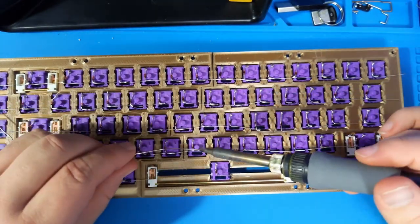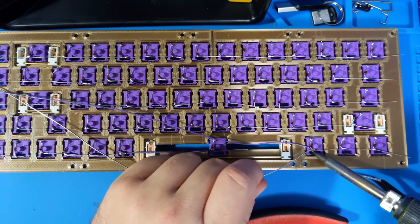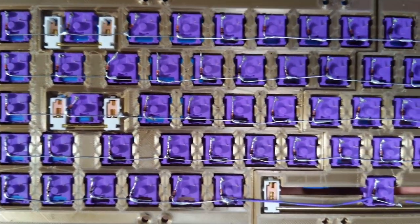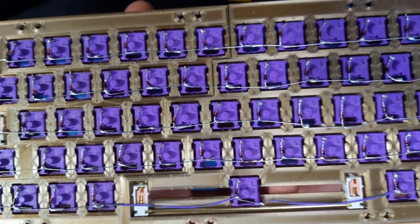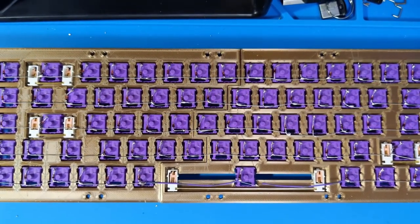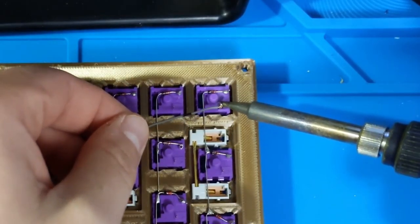After the rows on both sides of the keyboard have been wired up, I will connect them together. Some of the switches that are very far apart, like the spacebar, will require a jumper wire to complete the row. Here is a completed look at all five keyboard rows. To finish building the matrix, the second pin on each switch must now be connected in a column. Wiring the columns is a little bit less straightforward than the rows — no more diodes are required, but you do have a choice in how you connect each switch.